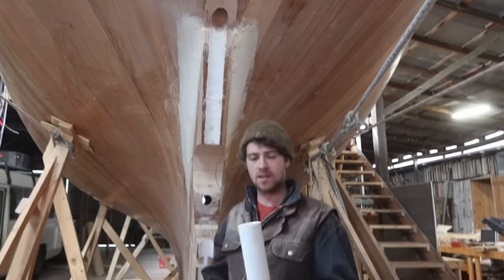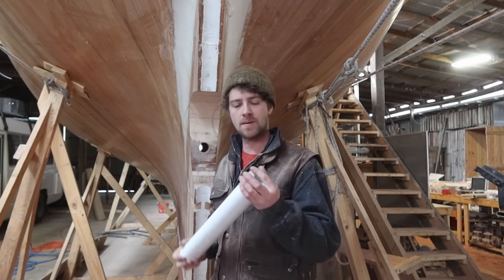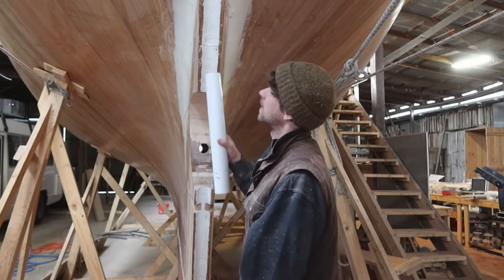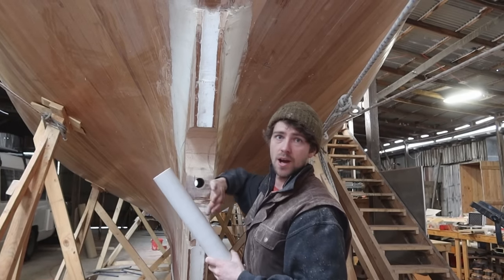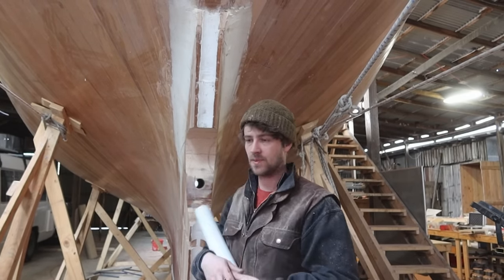We're going to make a couple of flanges, top and bottom, or maybe just top, to hold it in place. So this will help align the rudder stock and the whole rudder down. So when we're setting it up, we'll drop the shaft in, that'll go into the big bronze casting for the rudder we've made, and keep it all in place.